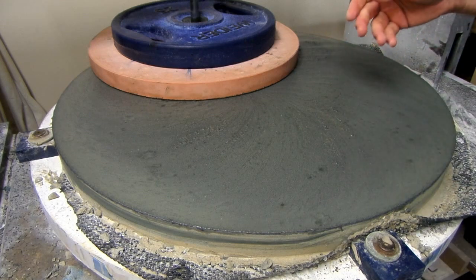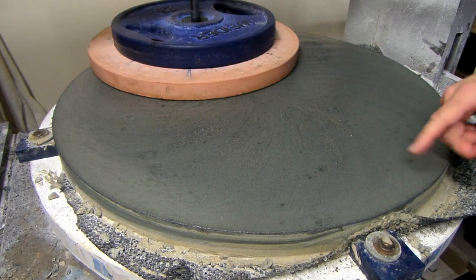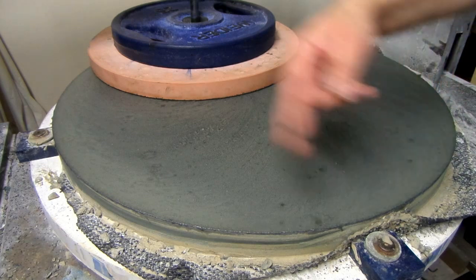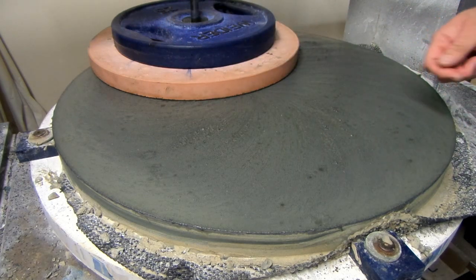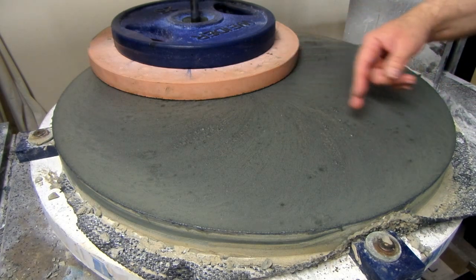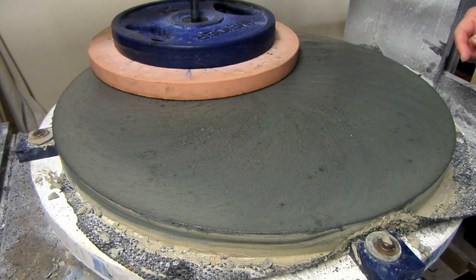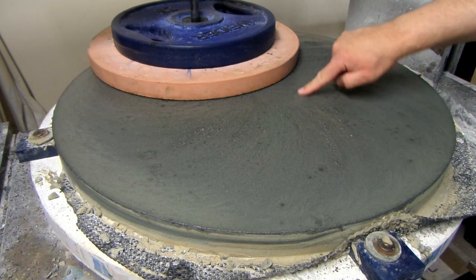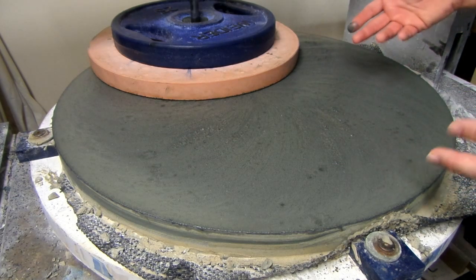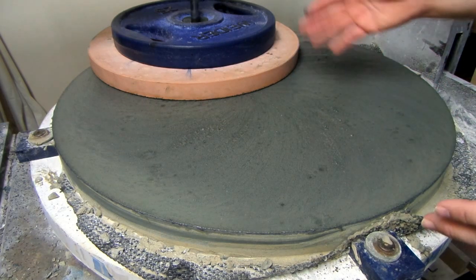What you might have noticed when I put on abrasive is I put it on from the center out toward the edge, but I don't go all the way to the outside. If this were turning at 60 RPMs, this two-foot diameter mirror would have about six feet per second speed on the outside — if you drop abrasive out there it just gets flung off and doesn't get used. So I distribute the abrasive in here and that force helps spread it out to the edge. Normally I'd keep doing this for 20 to 30 minutes, then use a little sponge to take the swarf off.